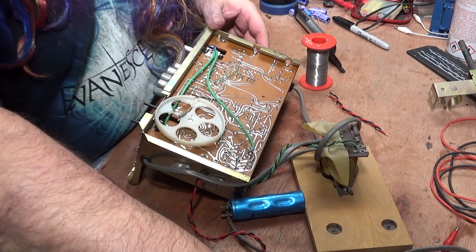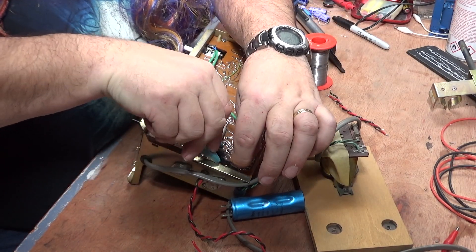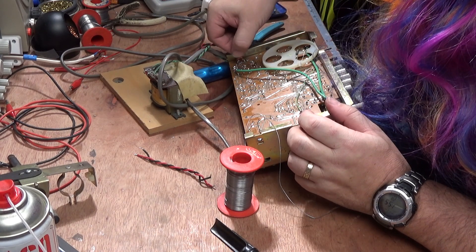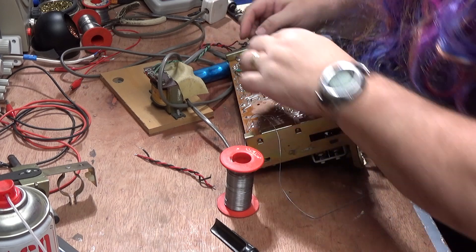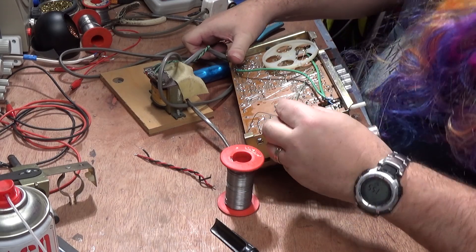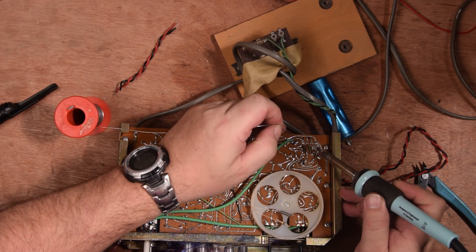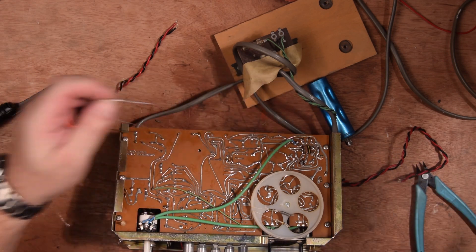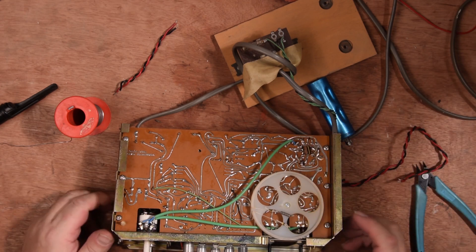Let's glue that one in. Look at the joint - yes, nice. Snip the ends off. Then we're left with the tropical fish which has to go back into these holes here. Now as you see it's designed to fit into a number of holes, but what we shall do is just tip it over slightly so that it stays level - well below the level of this actually. Helps if you don't move it when you solder it. Just solder it in like that, and as you see that is in, it's not going anywhere.